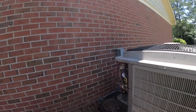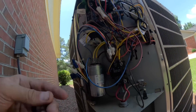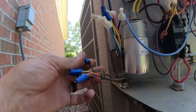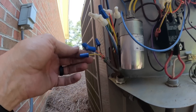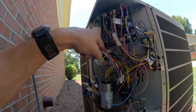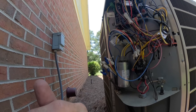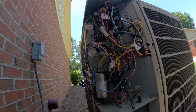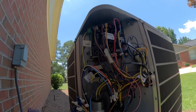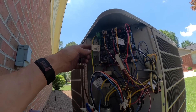Let me go get one. We've turned on the power and we're waiting for it to time out. This system, if you'll notice, does not have the red wire hooked up. It's got black for second-stage cooling, orange in common, and white. It depends on 24 volts from this transformer to operate the system, so when you kill the power the contactor opens up. I think this may be part of the older Evolution line by Bryant. This could be set up as a purely communicating system, but it's not — they set it up with 24-volt controls.